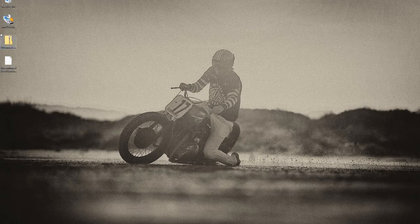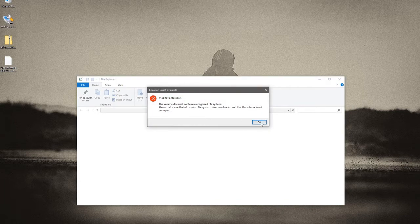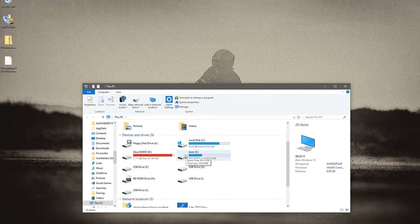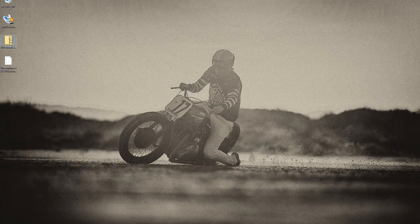While the OctoPi image is still downloading, let's insert the SD card — this 4GB card previously used in a Raspberry Pi — into the card reader. Windows will go a bit crazy and show two drives and ask to format them; just say no to everything. Opening up 'This PC' you'll see an E drive of only 60 megabytes and a J drive that's inaccessible. That's because they're formatted for Linux — which is exactly why we downloaded the SD Formatter.